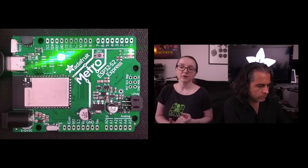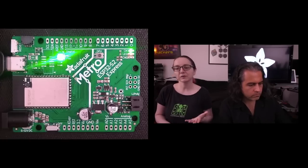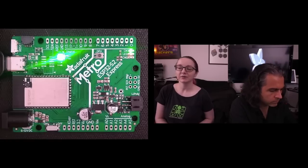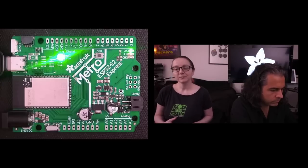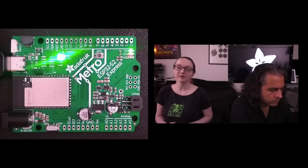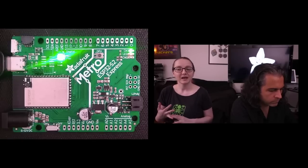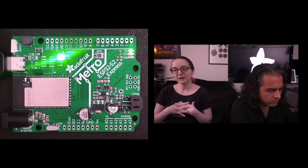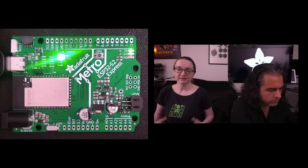but it does have both Arduino and CircuitPython support. Both CircuitPython and Arduino are beta, but they do work. You can connect to the internet and get stuff. It has a built-in LiPoly charger and can run off a LiPoly battery, so it's very handy if you want to make your project portable. There's a built-in NeoPixel, an optional debug port if you'd like to use JTAG debugging, and you can also use a DC power jack for 9-volt power in.